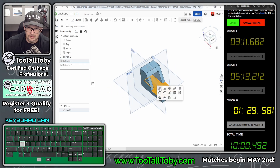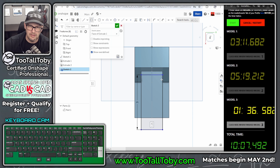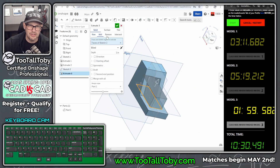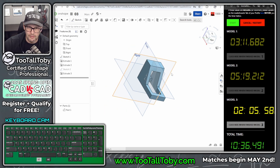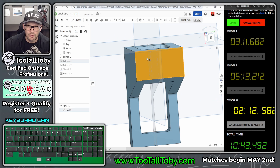Pick this face, begin a sketch, and create a rectangular shape from edge to edge with a total length of 3 inches, located 0.5 inches from the front edge. It's faster to add the fillets in the sketch here rather than as a feature — 0.125 inches for those four fillets. That gives a beautiful fully defined sketch ready to be cut extruded. Remember: no exploit shortcuts are allowed — geometry must be located correctly.